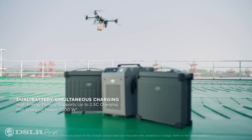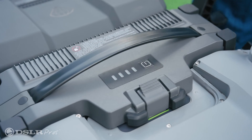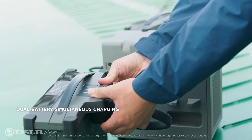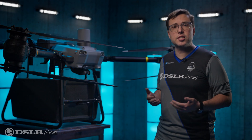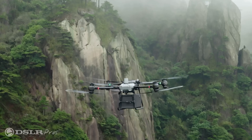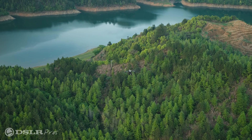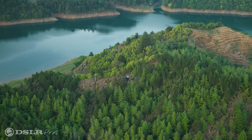What allows the Fly Cart to fly incredible distances carrying the weight of the airframe and the cargo are these immense batteries. The batteries are hot swappable, so you don't have to power down the drone to change them. It's also a redundant system, meaning the craft can operate with only one battery. In fact, with only one battery, the cargo capacity increases from 66 pounds to 88 pounds because the removal of one battery drops the airframe's weight considerably.